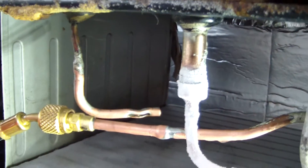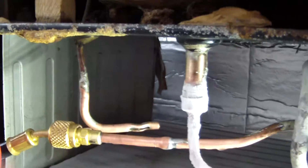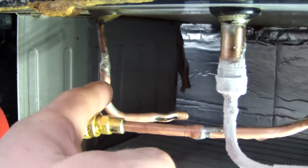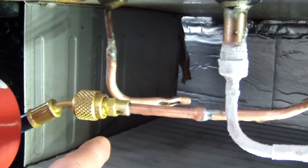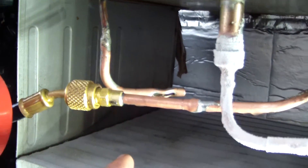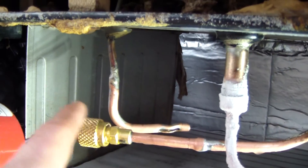So what I did there was just tie into the low side of that and left the high side crimped. Whenever I'm done doing my work on this thing — painting, rewiring, and whatnot — I intend to bring this line down with a high-side Schrader and then bend the low-side down beside it, or connect them with some kind of clamp.